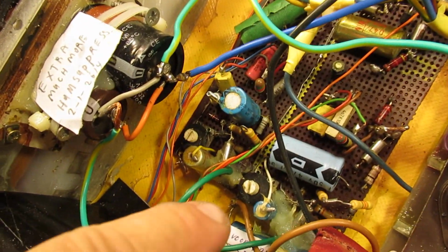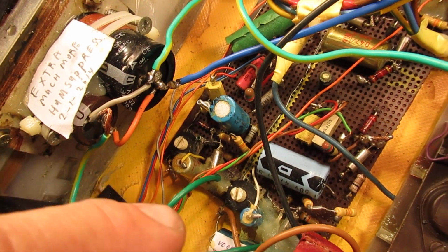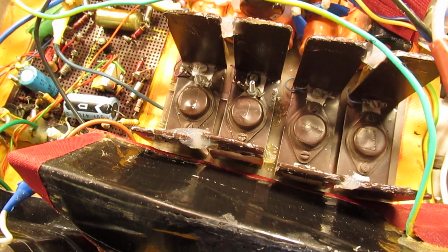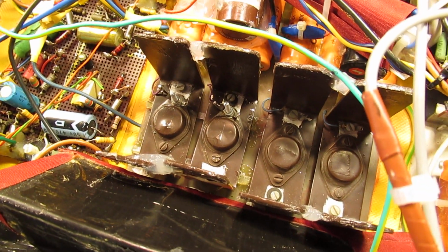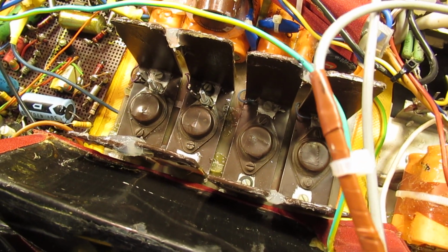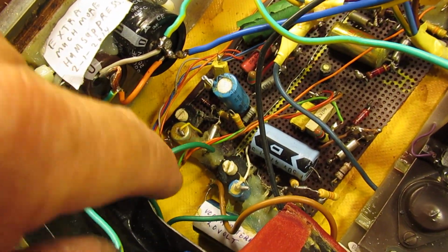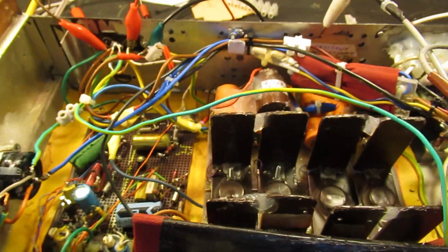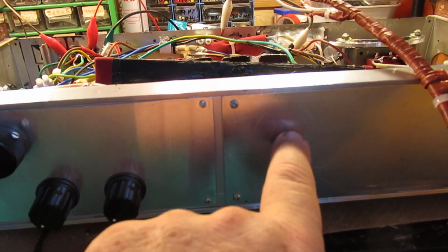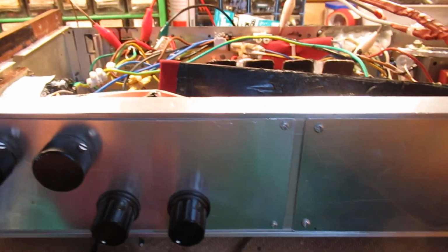And important to tell, here you can set the amplification of the preamplifier, so you can overdrive the end amplifier, and that's good, especially for guitar, because sometimes with guitar amplifiers we need a kind of distorted sound. Anyway, I'm gonna move these two potentiometers to the front. That will be the next adaptation, so they will be here or so, or here, doesn't matter. Have to use shielded cable, absolutely sure. But anyway, let's listen.